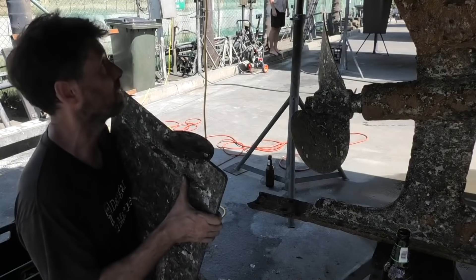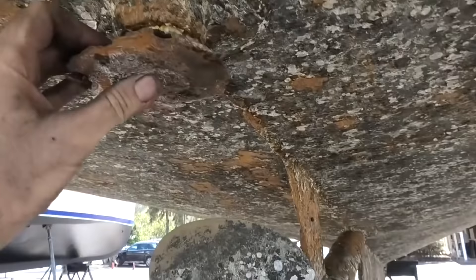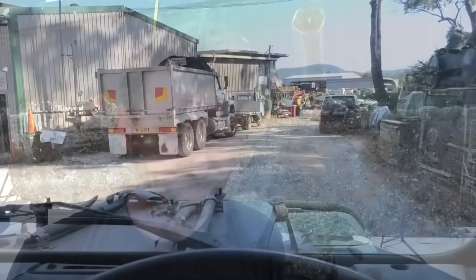Didn't even have to undo the last bolt — it's so corroded the flange at the top. You can see the flange for this rudder post and the shaft here is really eaten away, though the metal of the hull around it doesn't look too bad, which is good. I'm going to have a go at using electrolysis to clean this up. But for now, I'm going to duck down to the local oyster farm and have a chat to them and see about finding a space to put this for a month or so. Had a few beers with the guys — that's where all business is done — and sounds like we've got a place we can put the boat, which is great.